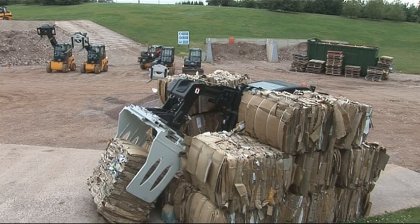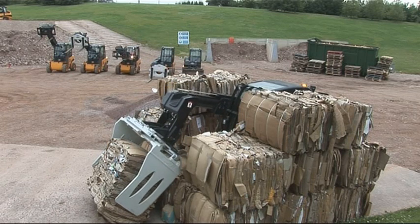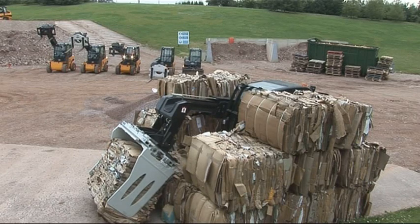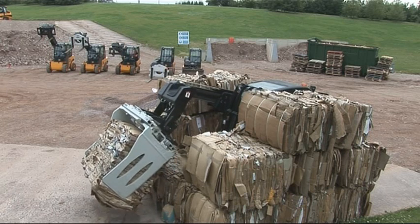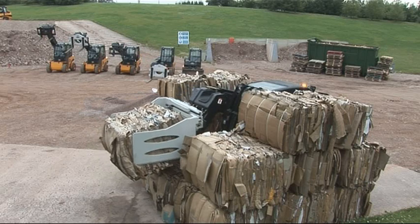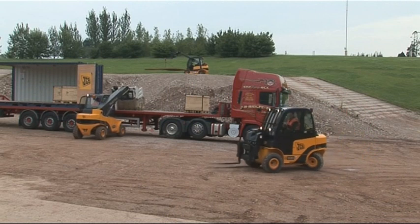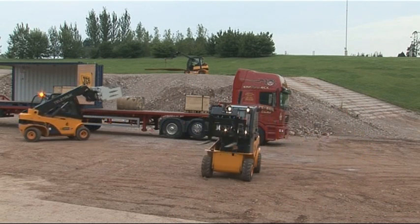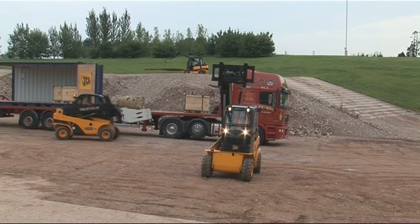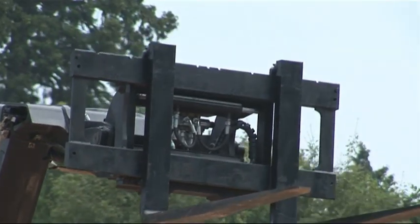This machine is not only perfect for reach, but it's also got good traction — it's a 4x4. Typical to this type of environment with waste paper and plastic bales, the ground conditions might not be perfect, so a 4x4 really does make the difference. This machine is a little bit larger than our two-wheel drive equivalent, with a turning radius of 2.9 metres, a maximum lift height of 4 metres, and a capacity of 3 tonnes.